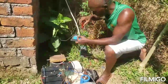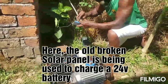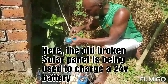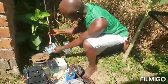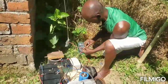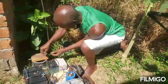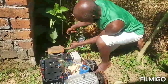This solar charger is a smart charge controller. You are supposed to connect your battery to the charge controller first before you connect the solar panel. So let us do that — positive terminal of battery to the positive output of the charge controller, negative to the negative output of the charge controller. The charge controller at this point will show us the voltage of the battery.